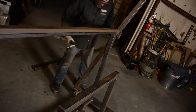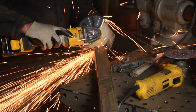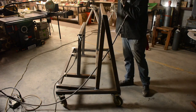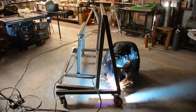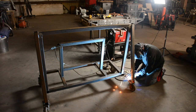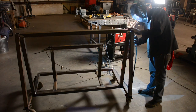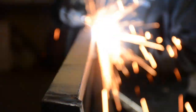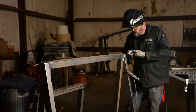This thing is very, very sturdy. But just as a matter of insurance — because five or ten sheets of plywood are extremely heavy — I'm putting this back brace so that all the force is shared amongst the braces that carry the wheels. I capped the top of these tubes as well. The back of the wheel braces I did not cap since they'll always be against the wall. But since these are faced up, I'm capping them — tacking it and then grinding it into place.